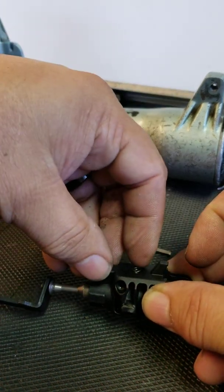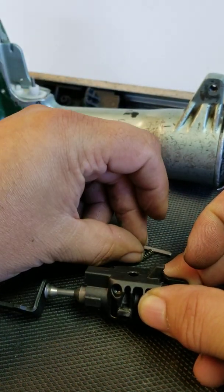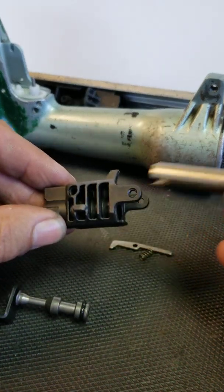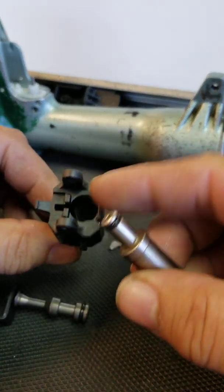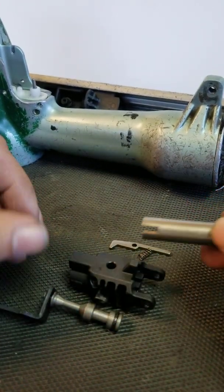It may — I'm not sure if it'll jump all the way out, but just in case I don't want to lose it. There's that spring that everybody has a hard time with. Now we can safely pull out both plungers, inspect the bushing itself, the O-rings, and the plungers. Make sure everything is okay, good to go.